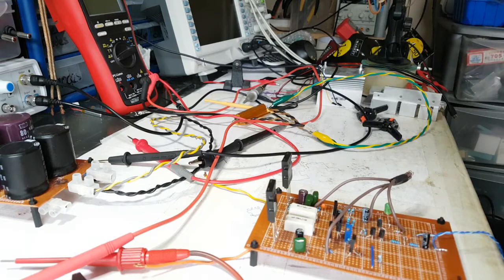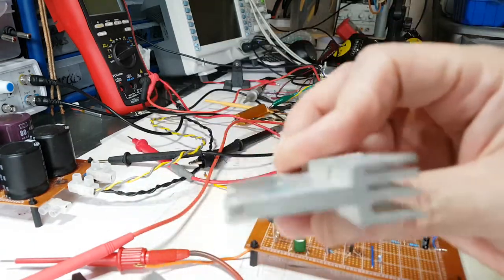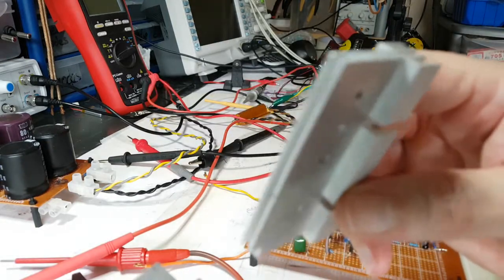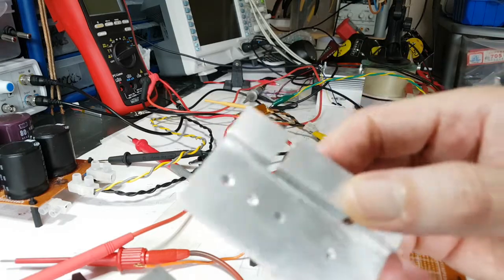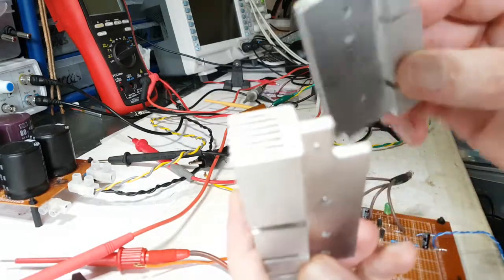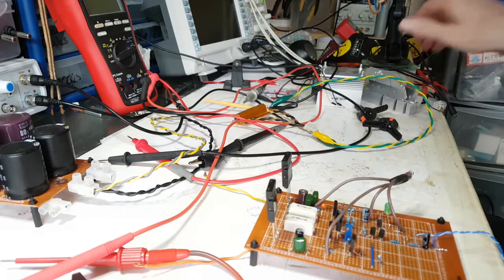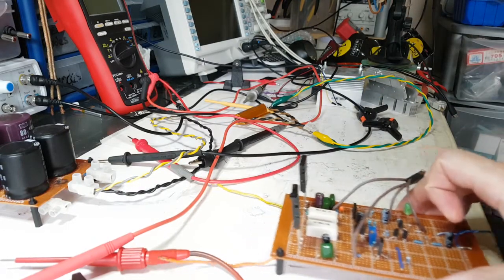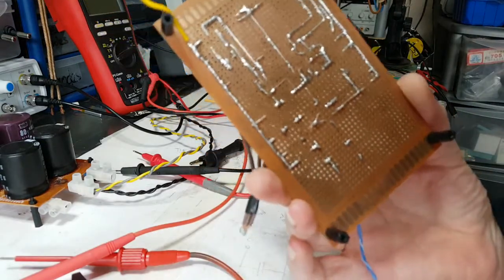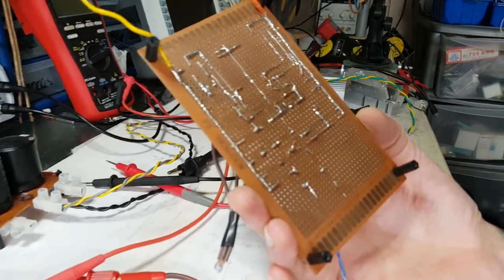And take that off. Right, so that should be okay using this, because this is the same size, even a little bit chunkier than on the other channel, and that survived the 70 volts, 16.5 volt output RMS test. So this, which has got even more to it than this, should be fine for this channel too. Now let's see what's wrong with this. So I went over all the connections, and I know this isn't the prettiest of soldering. I know it's not as pretty as the other one, but this one's had to be taken apart a couple of times.